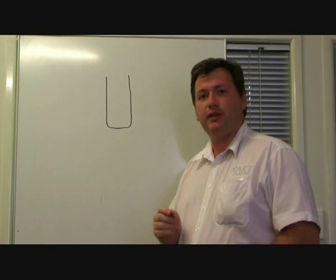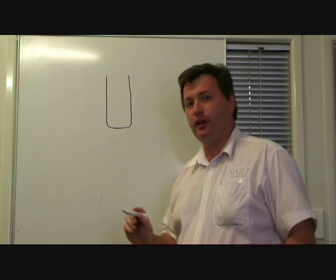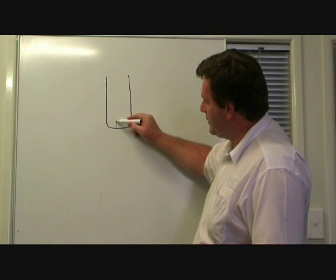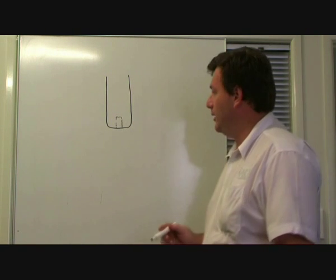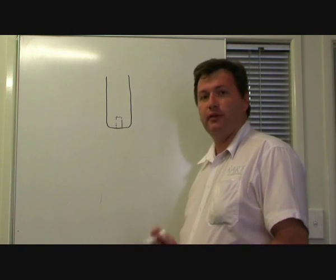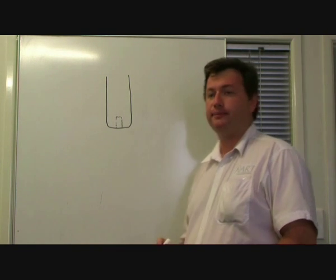But you'll notice something special if you look right on the very tip. In fact, on the lower end of the electrode, you'll see that there's a tiny piece of silver metal which is inserted inside the electrode. And it's actually this piece of hafnium, as it's called, that does most of the work during the cutting process.